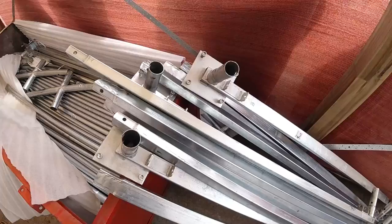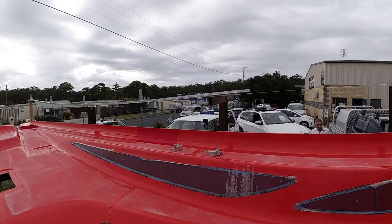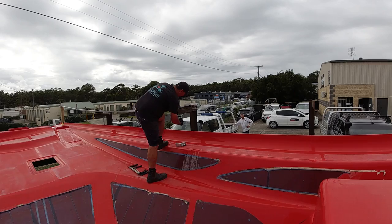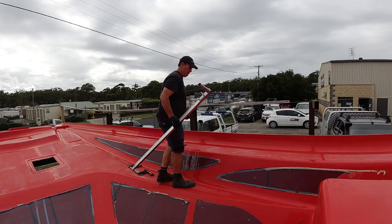Now, I was really delighted to discover that this tent had a very different system to the previous one. The previous one, as you can see above my head here, had purlins that I had to actually buy to form the base of the actual tent hoops, whereas this one, the base came with it, and that's this extended bottom plate that is actually extending across these cantilevered arms that I put in place. Now, this actually saved me a hell of a lot of time and a lot of money. I already had the purlins ready to put on there, but it saved so much time the way the whole thing interlocked, and obviously a different brand, different method, and it was a much, much easier tent to install this one than the previous one.